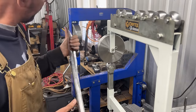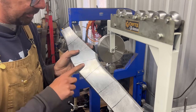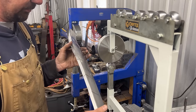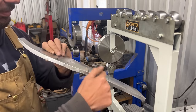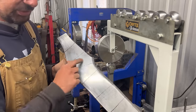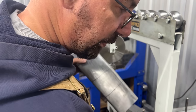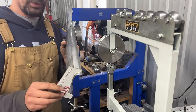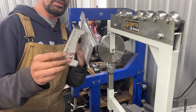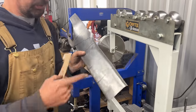Okay, so with the smaller English wheel, I was able to go closer to the walls here, and now it looks much better, except this belly here that we had is still there. At least the rest of it is smoothened out, and I checked it a few times with the gauges, so most of them look pretty good. So number 9, for example, is this one, and we're pretty close. I mean, the curve still needs to be worked on, but we almost have the correct shape here. That's number 8 here.